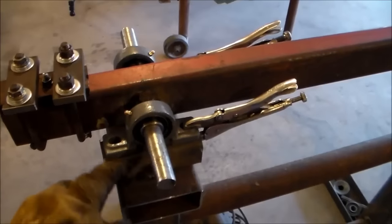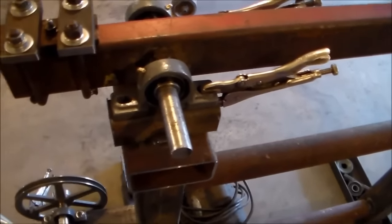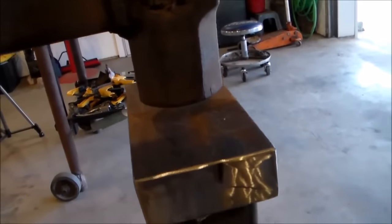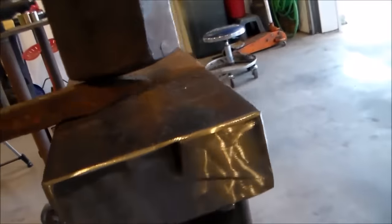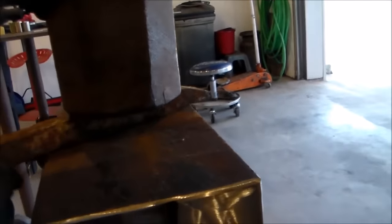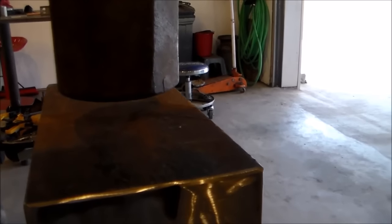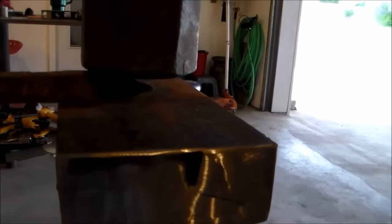I still haven't finalized and committed to bolting here — I think I'm going to move these blocks out just a touch. That's what the anvil and hammer are going to look like. The adjustment is going to be to keep the hammer maybe about as far away from the anvil surface as the thickness of the metal you're working, because you're not solely striking the anvil — you're using that spring to kind of help whip it, and it'll soften the blow against the anvil.